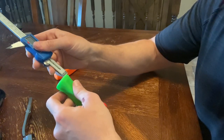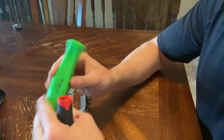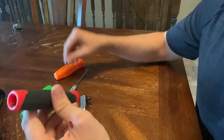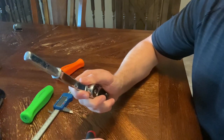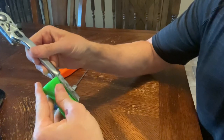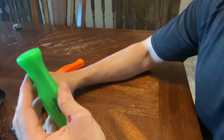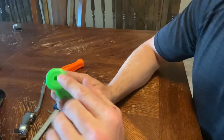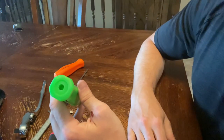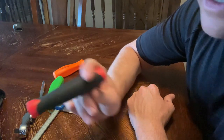So you can measure the depth and that tells you how far you need to drill. Interestingly, Snap-on doesn't drill all the way to the bottom — they stop about halfway — but Pittsburgh goes all the way to the bottom even though the shaft doesn't go that far. So I'd measure just the shaft depth, mark it, and drill down accordingly. I'd do it in steps — incremental drills — not one big one right at the start. Then I'm going to throw this back in the boiling water for a bit before reinstalling.